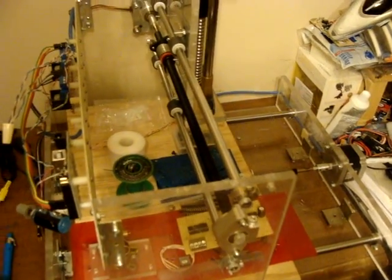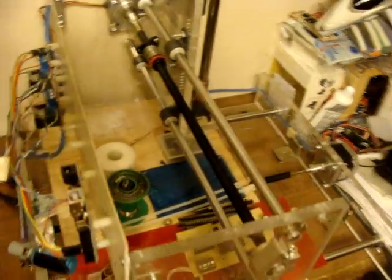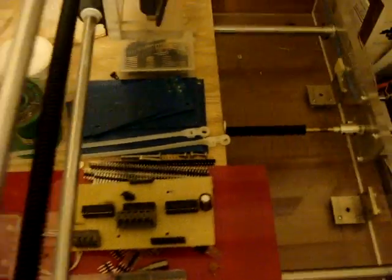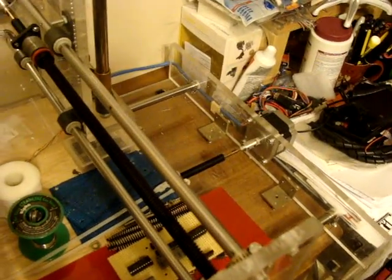Tonight we're testing out the X and Y axis servos. What we're running is an Arduino with L298 controllers. I've got L297s, so I'm making a 297 interface board for better performance, but just a quick demonstration of it running.